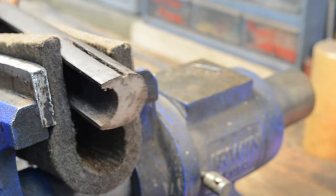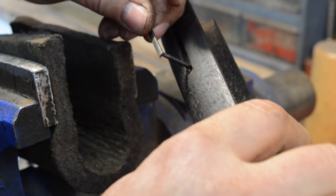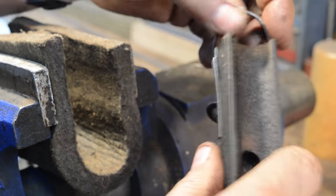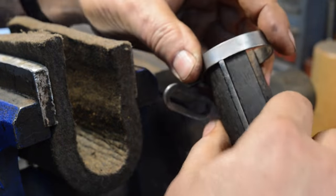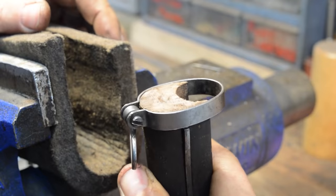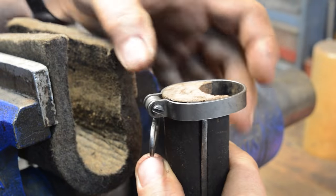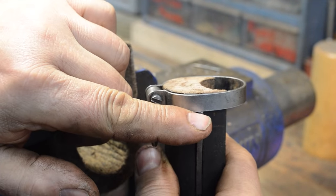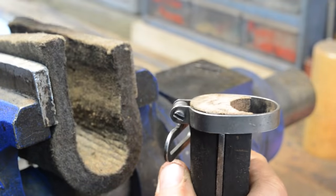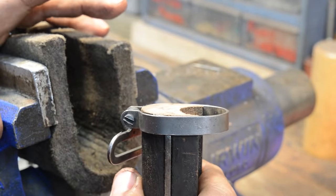All right, so now we've got this fore end piece taken right to the back end of the stop cut. So the locking piece would go in there like that. And then the barrel band is gonna sit on here like this. And we can see now that we're absolutely flush here. And that's the way that side should go. And then we'll make the other side of this cut ever so slightly shorter so that there's just not enough room in between this end of the barrel band lock and the back end, the part that it's gonna butt up against. And then we can just ever so slightly milk this joint open and make this band real tight. And that's what we're hunting for.